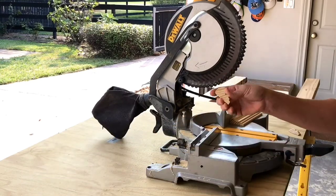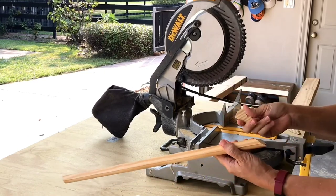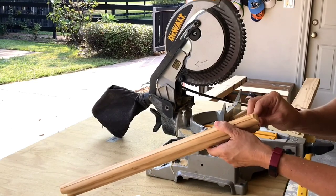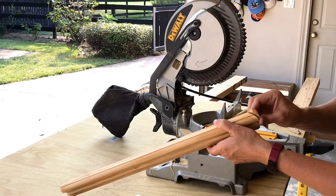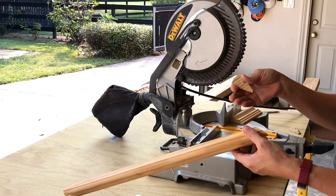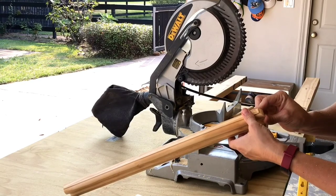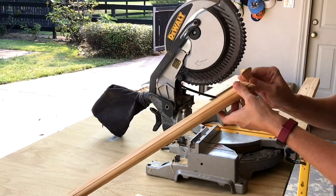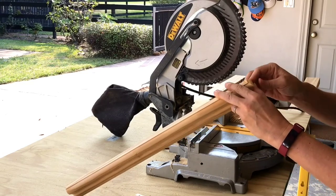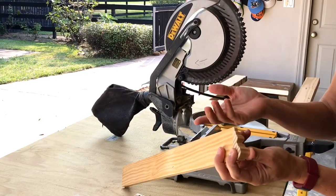I do want to say that if this was a smaller piece of molding, this would be a really tiny, easy-to-break-off piece, so just be careful with that. Now you've got a couple of options for attaching this. You could use regular wood glue and painter's tape to hold it in place while the wood glue dries. Or you could use something like DAP Rapid Fuse wood glue — sort of like super glue for woodworking projects. That would be my preference because I like to hurry up and get back to work. Another option is if you have a pin nailer, something with a small gauge nail, but I would be really careful of that, especially with the smaller ends — you're going to easily break that.